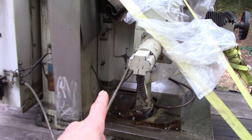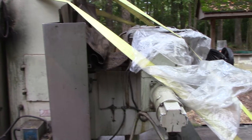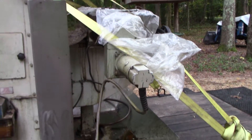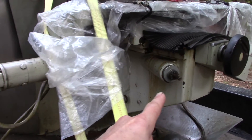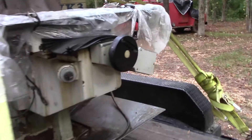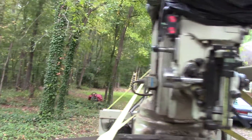The knee is box way construction. The in-and-out Y-ways are also box way construction. The table is actually dovetail way with brush servo motor type drive. It's got three Z-axis adjustments, which is kind of interesting - the regular hand crank for the knee and the regular quill feed like you'd normally have.